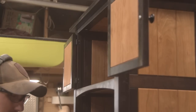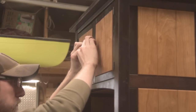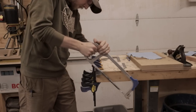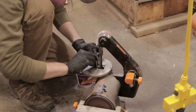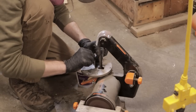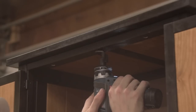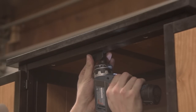Now my first thought is that I'd screwed up something in the glue up of the doors. For some reason I hadn't glued them up as square as I thought I had. But when I checked them, they were pretty square. What I realized had happened is that the whole cabinet section was just a little bit out of square. And it's that little bit that then, when you pass that through the doors and get that lined up in the middle, ends up as that major error. So I'm glad to say that I did leave that adjustability in there and it did save my butt. It was a little bit of a stressful moment, but I'm very excited that I was able to get things all tuned up so that the doors were sitting perfectly in line with each other.